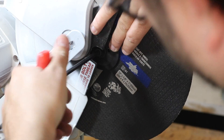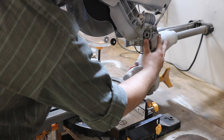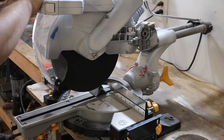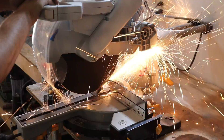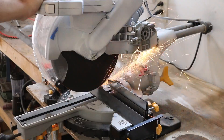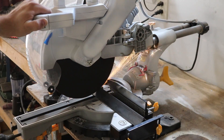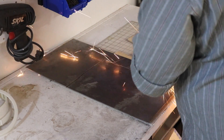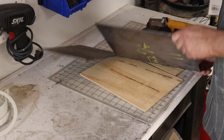For some of the angled cuts I'd be doing for this project, I used my miter saw with a chop saw blade in it — same specs, same power — and now I can make more complex angled cuts, like compound cuts for the legs. The 11 gauge sheet metal for the base I'm just cutting with the angle grinder. It's messy and it's loud, but it works perfectly for stuff like this.